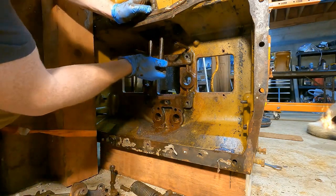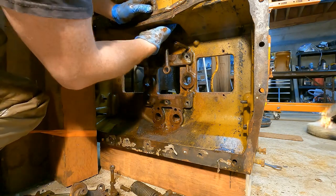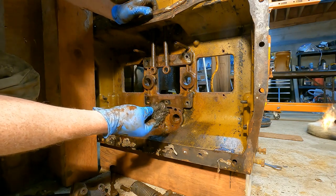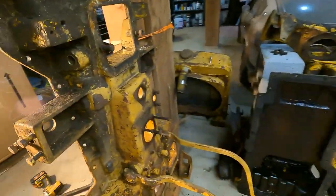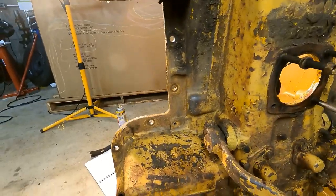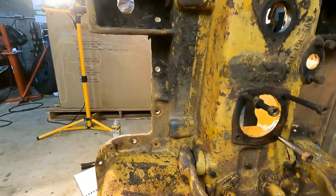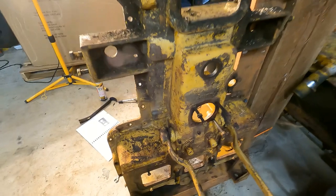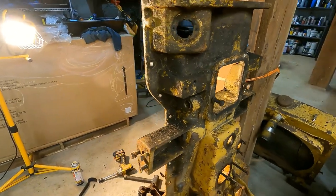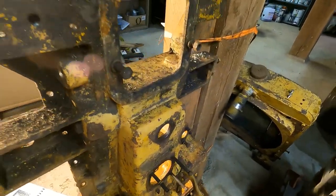Oh my - that's where they've been shooting all the grease. This is fresh grease too - this looks not too old. So there are grease fittings here and clearly someone's been hitting those things. That's why there's really not much play in this - there's a little bit, but not even half as much as what was on the clutch, which does not have any grease fittings on it. Maybe I should add grease fittings to the clutch linkage - one up here and one on the part that goes over there. I'll think about it.